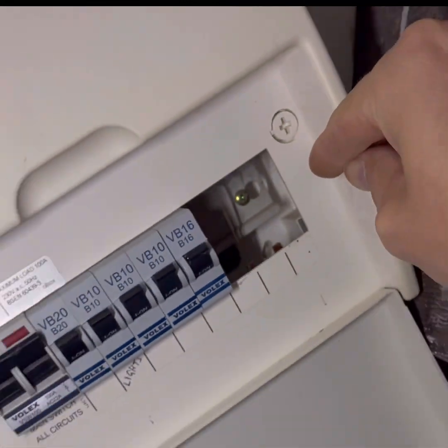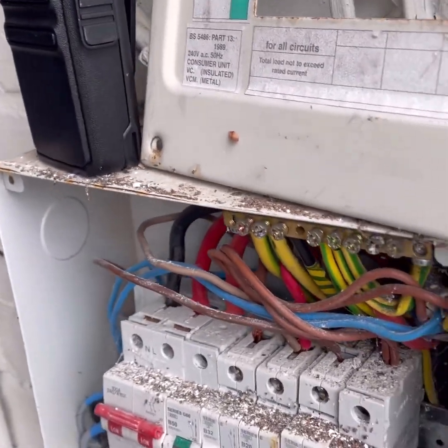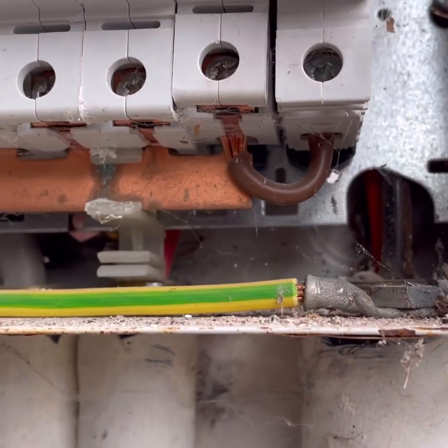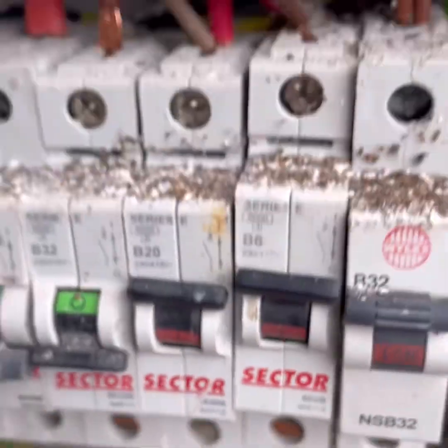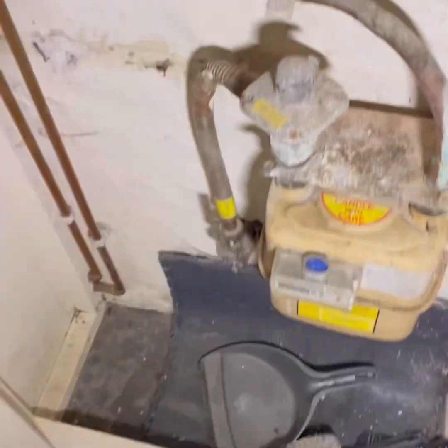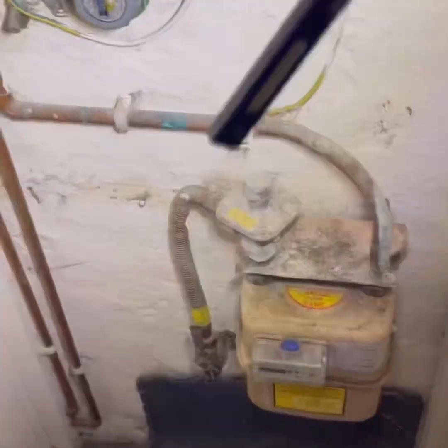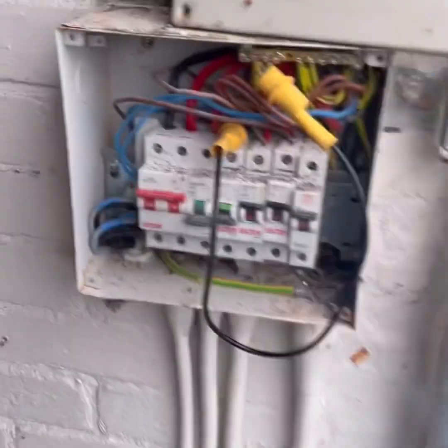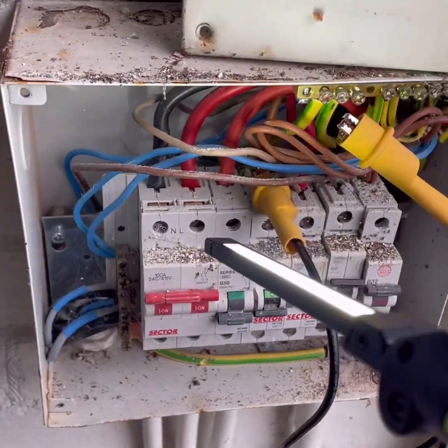There's no RCD protection serving all these sockets and lights, and there's a great big hole in the front of the board. Also just to add - a John Ward video about exporting PMEs covers this well and I'll put the link here. For some reason I've never seen this before: they've got a second gas meter supply to this annex, but I've already noticed that the 10mm bonding conductor to the meter is not from this consumer unit. It's coming from the 16mm twin-and-earth with the 6mm CPC which goes up to here.